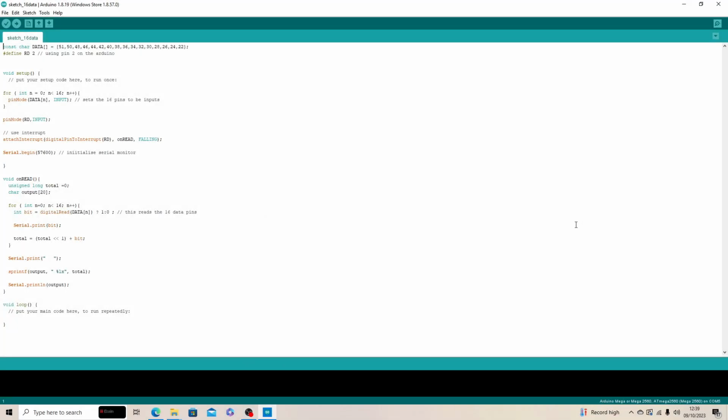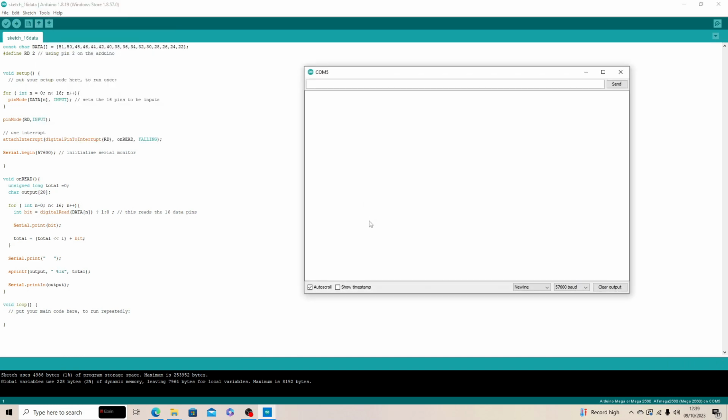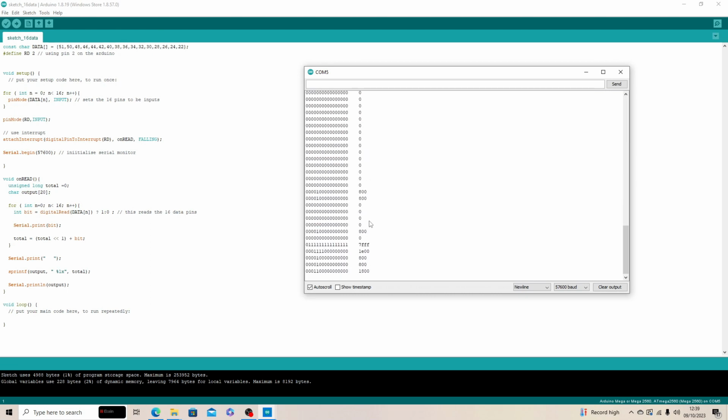So I connect the Arduino, I upload the sketch so we can monitor the data pins. It's done uploading. I then open the serial monitor so we can monitor what's coming out. I connect power to the board and we get some spurious data coming through until we go through the reset signal. And then we let the reset go through the clock signals. And there we go. 20B0, 60B4 and 1204. The test data is coming through and is being read by the 8086.